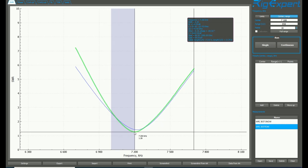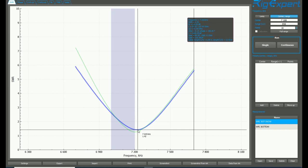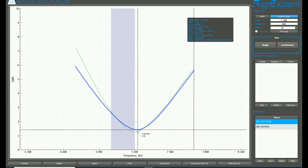If we take a look at our two scans, the first one in green was done in November with no snow on the ground. The center frequency is at 7200 kilohertz in the 40 meter band and the SWR is at 1.26 to 1. The second sweep highlighted in purple — the SWR at 7200 is at 1.43 to 1. The lowest is at 1.42 to 1, just a little bit higher up the band.